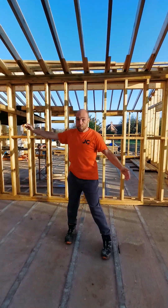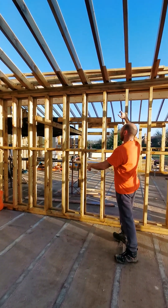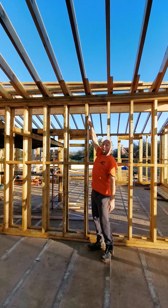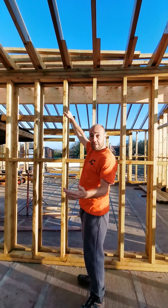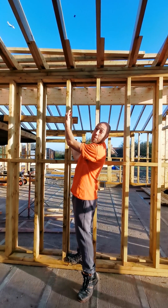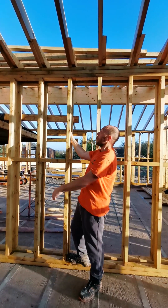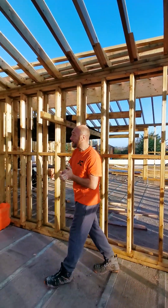Along our stud walls, we've worked it out with plasterboard. What we try and do is make it so all the rafters come down on the stud wall with a stud underneath. It doesn't matter too much because usually we'd have a double plate — we've actually done a triple plate at the top. But we like everything to sit solid; it's just good practice.